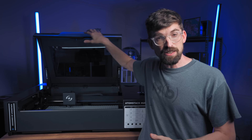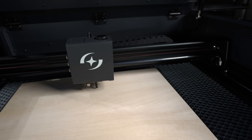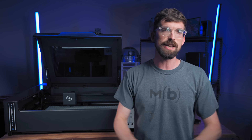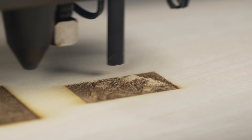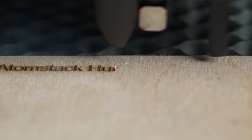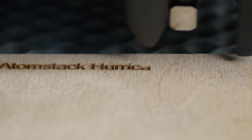Some quick specs: this is 55 watts with a CO2 tube on the back. You've got a work area of 500 by 300 millimeters, which works out to just shy of 20 by 12 inches, with a removable honeycomb bed inside — pretty much this bed is the work area. In terms of max speed, this is 600 millimeters per second, which is usually another big difference over diode machines. They typically run faster, really utilizing the increased power with quick accelerations that you need when doing lots of engraving.